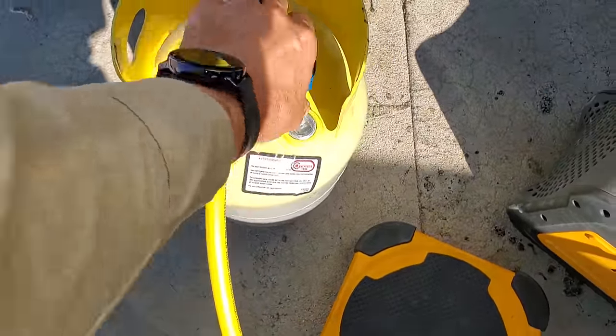I would assume, being that this is the third stage and it rarely gets cleaned properly, this unit's been running pretty dirty for a while. The customer doesn't do regular maintenance. They're probably messing with the oil. The oil's probably getting cooked in that compressor, which isn't good. We'll have to monitor it. Maybe get them to let us come back and do a follow-up and make sure that new dryer's not plugging up.